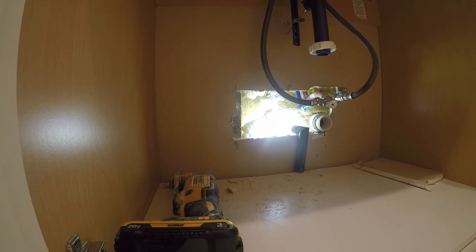I don't think I would ever install an air conditioning unit without running conduit for the electrical in such a way that I could replace it along with the control wires, because that has been the issue for me.